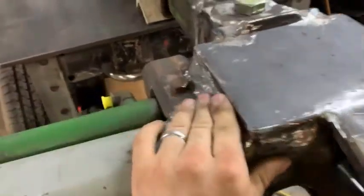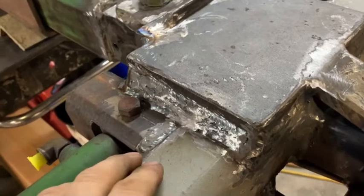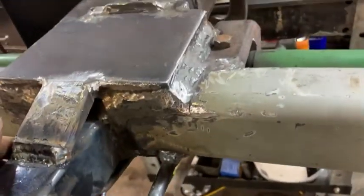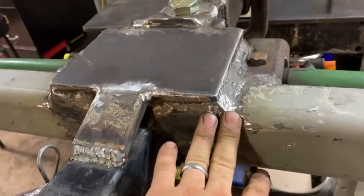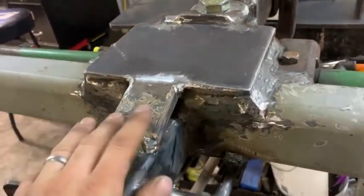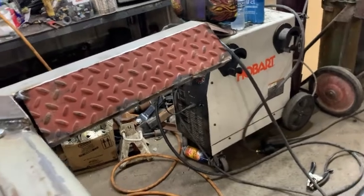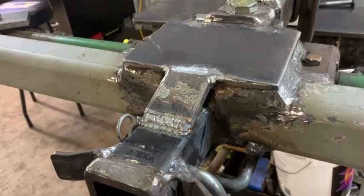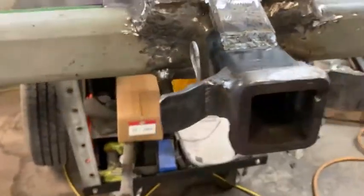You can see all this is welded up. I'm going to try to clean up some of these burrs a little bit more and hopefully blend it together with a sandblaster before I put paint on it. My welder doesn't quite burn hot enough, which is why I took the grinder to it and cut off the peaks of my welds. As far as I know there's no porosity in it — I'm pretty confident — but they're not the prettiest. I should have stick welded it, but I've got small gauge hard wire in it so if I turn the amps up too high it doesn't like it.